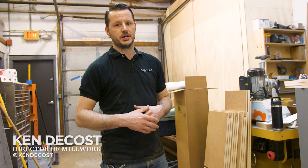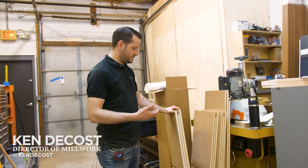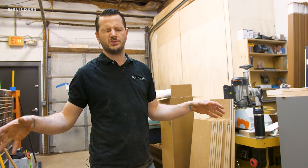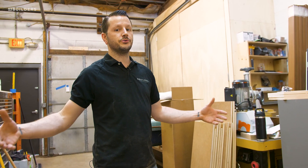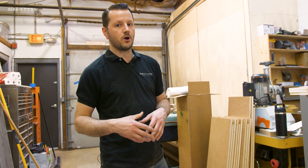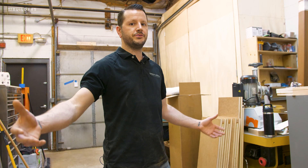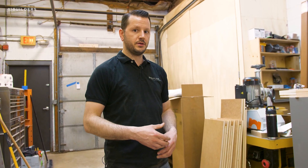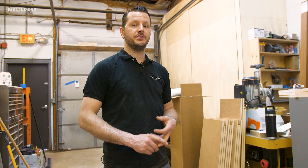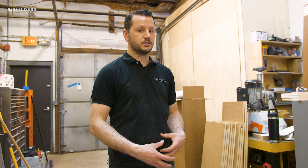With millwork well underway for our Cambridge project, we're here in the shop fabricating some bookcases. These are the horizontal shelves for these cases — they look kind of weird but we'll unpack that. One is going to be about 42 inches and the other just under 10 feet. Because these bookcases are going to support a lot of weight, we came up with a pretty wild joinery method that is going to be very structurally supportive and also hide a lot of the seams and cuts, giving us a little wiggle room to assemble the parts.